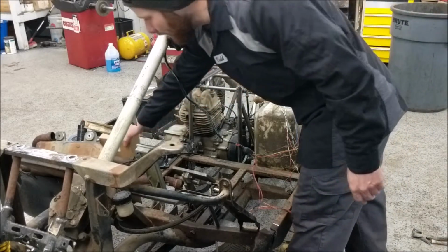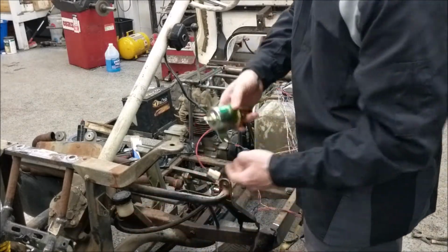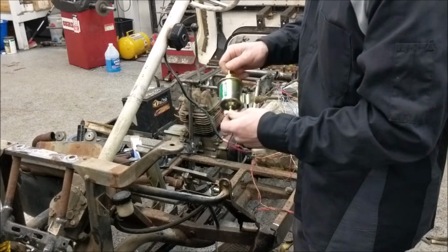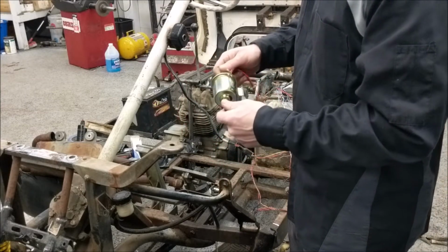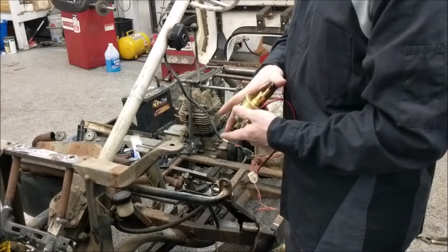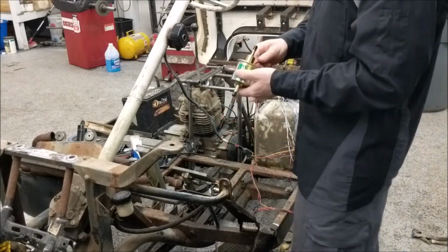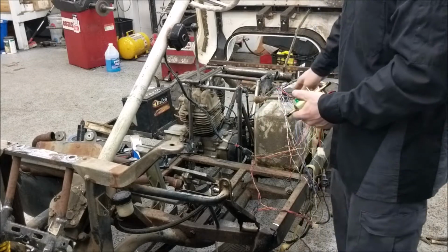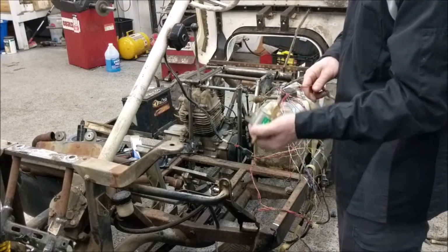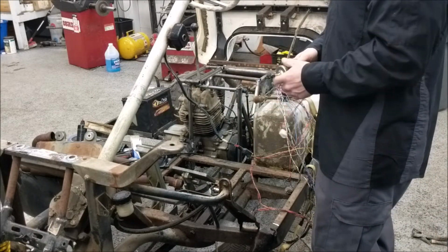We also got an electric fuel pump, this nice little guy here, which pumps very low pressure. It's only like 2 to 3 or 4 pounds or something like that. Because this is a regular carburetor with a float, a small carburetor, we can't add a lot of pressure to it. So this will get fuel from our new fuel tank to the carburetor just fine, because these are actually meant for quads, UTVs, and stuff like that. So this will be perfectly fine.